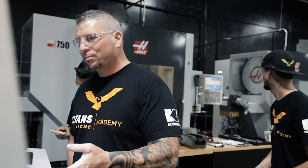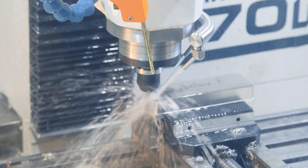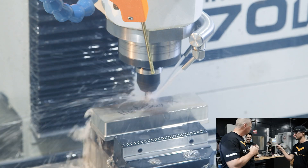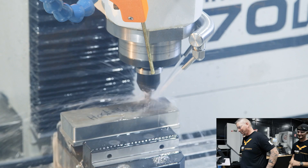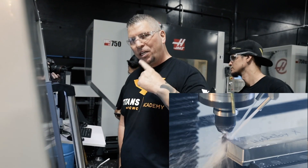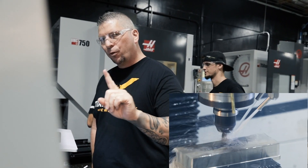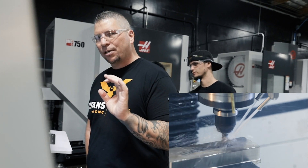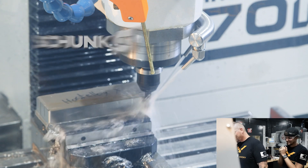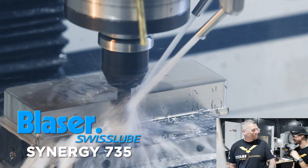Let's see if it's gonna work or just stop. It's definitely the first time I've heard it in the low belt — it's a lot stronger. Great job, guys — they changed the belt down so we get all the power we can get. My philosophy here is instead of putting more pressure on it, let's keep the free-cutting chips. Keep everything the same but take a deeper cut, which adds more pressure, but because you're thinning out those chips it's not going to be as bad as cranking up the chip load. That's it — oh, you can hear it! It sounds like a good cut!